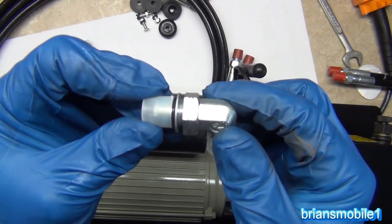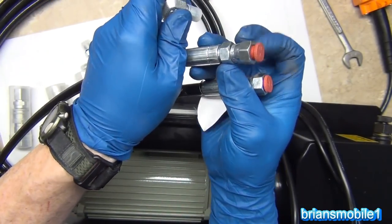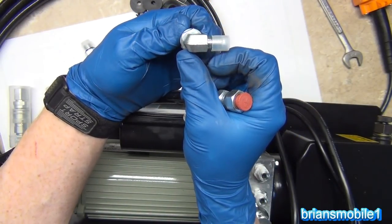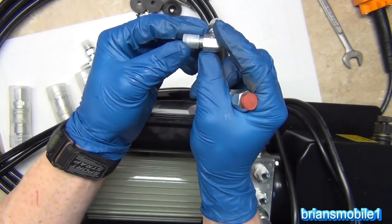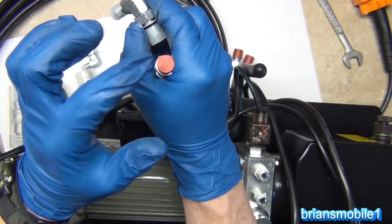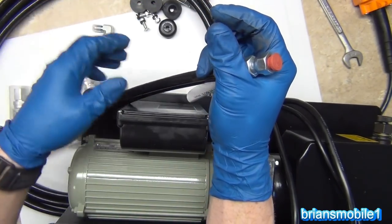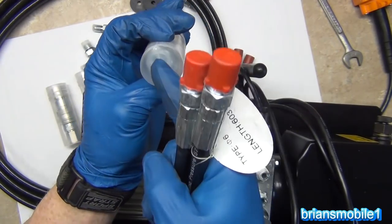See how there's an O-ring on that one? You've got two short hoses on one end where a nut spins freely — that goes onto the unit and you snug it down. You install them at the 10 o'clock position — so you've got 12, 3, 6, 9 — you want it slightly up so the hose doesn't arc toward the floor. You don't do Teflon on this one because it's a compression-type fitting that does the sealing, just like a bleeder on a caliper. The fittings on either end of the coupler do receive Teflon.